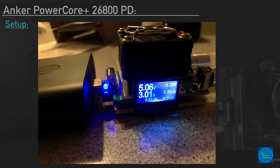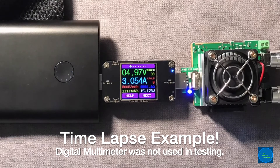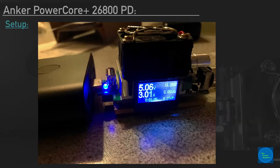I typically charge them up all the way, they sit for a couple of days, and then I'm using them for various things. When the battery was fully discharged — that was just when the load shut off and I saw the lights turn off on the battery pack — that was the end of charge. The unit was then plugged into another pack that was charged so I could read the values off of it, but I would turn the thumb dials down all the way so there's no additional current being drawn, to get an accurate reading. It was always charged using the supplied PD30 USB-C power adapter, and there were no overloads attached to it besides this synthetic load.